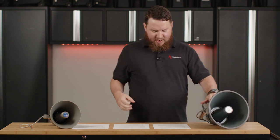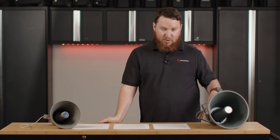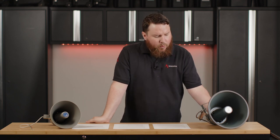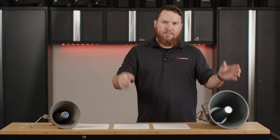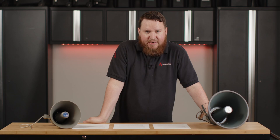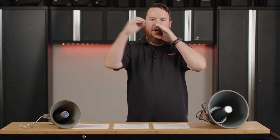The speaker has very high impedance versus the air, which has super low impedance. So the flare actually transforms that impedance, making a transition from the driver through the horn out into the air itself. The horn doesn't actually add any additional energy just by the shape of it — it makes it so that the driver produces a much higher output and radiates or covers a wider pattern area. It's kind of the same concept as if I'm just standing here talking, my voice sounds a certain way, but if I cup my hands over my mouth, now it gets a little bit louder even though I'm not talking louder, and also covers a wider area.